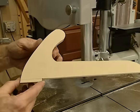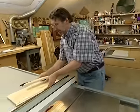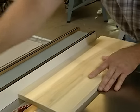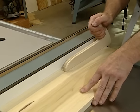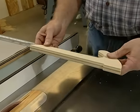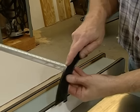This is one of the most valuable accessories you can make for your table saw, and it's the cheapest — it's called a push stick. It's an indispensable tool when ripping narrow pieces. I keep it nearby at all times, and if I'm ripping a narrow strip about two inches wide, I start the piece first, reach over, grab the stick, hook it on the back edge, and guide the piece through. It also comes in handy as a way to hold the saw blade when you want to take the nut off — it's wood, so it won't damage the carbide teeth. It's also useful to make a few small ones; you could make one out of plywood for narrower strips.